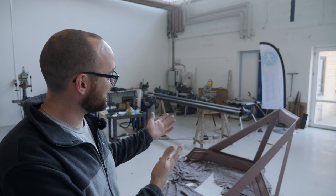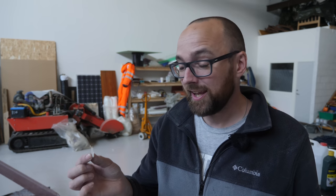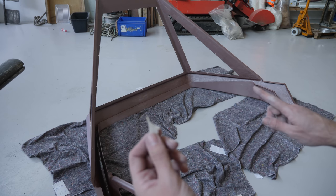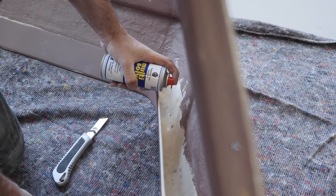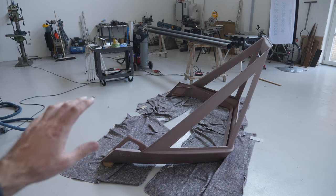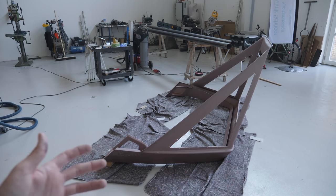Just like that the inside of the dodger is ready for top coat. That 30-second time lapse covered about four hours of work. A big chunk of that was spent dealing with a gift from one of the previous owners — a little bit of silicone that was used for securing wiring for a speaker that used to be right there. I removed the bulk of the silicone using a Stanley knife and then used this multi-solve stuff, which claims it can dissolve silicone. Time will tell if that's true, because if it doesn't work the paint job will fail. I'm going to leave the dodger sitting like this for about six hours to make sure I don't mess up the primer.